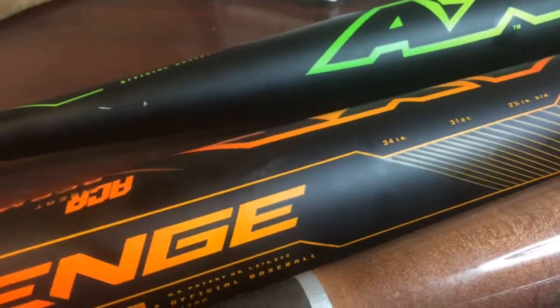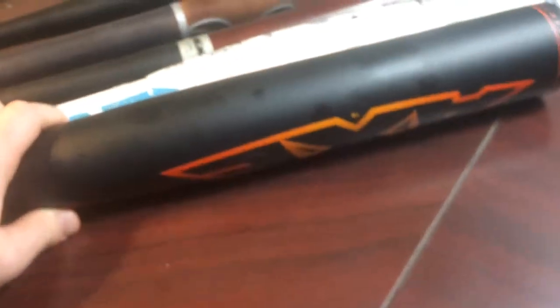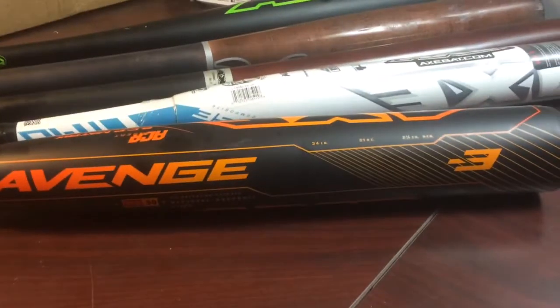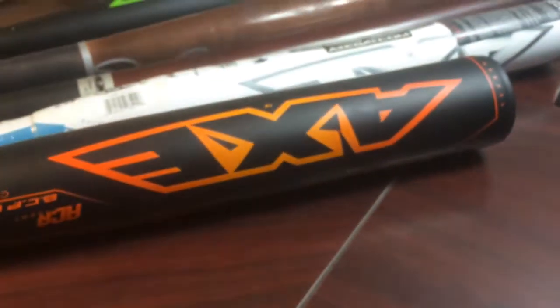The other thing that's unique about this bat is because you have an asymmetric handle, you're required to hit the bat on the same side. Because your handle's positioned here, they actually have the ability to control the side that the ball's going to hit. As a result, you can actually create a different type of barrel — a stronger barrel on the hitting side versus the other side. They have a directional centerpiece, which is like a ring that's actually forced towards the hitting side of the barrel. Because of that, you can create more consistency and a bigger barrel. Because of this asymmetric handle, you get a lot of liberty in the manufacturing of the bat.